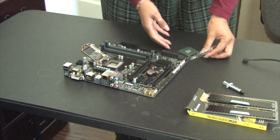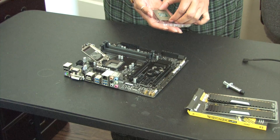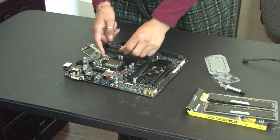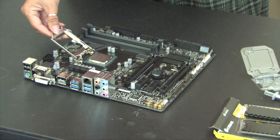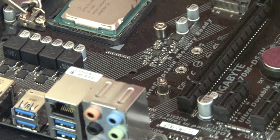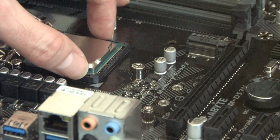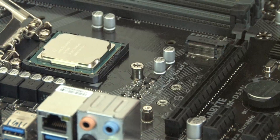I was looking at the board and just to be really clear — let me zoom in real quick so you can see — notice the triangle that was perfectly visible. So you'll notice the triangle where it's seated down. The lining up of pin one: it doesn't really let you put it in the wrong way, but it's always good to make sure you're putting it in correctly.